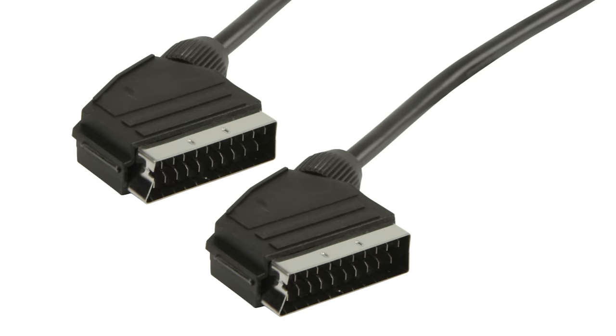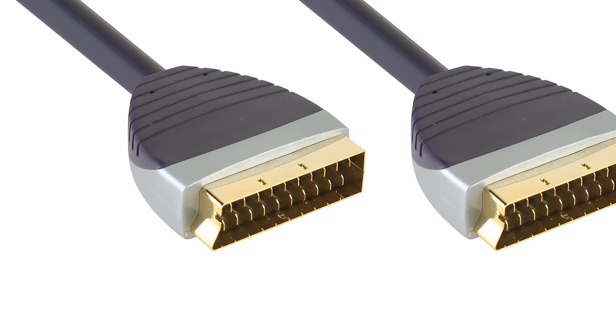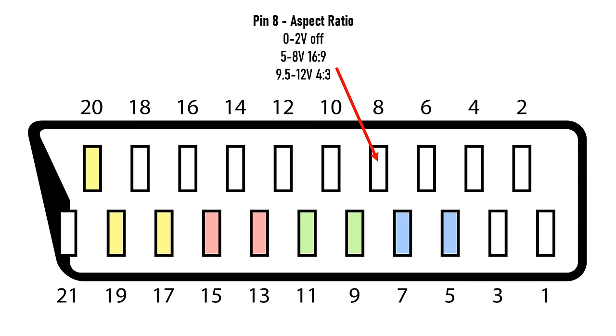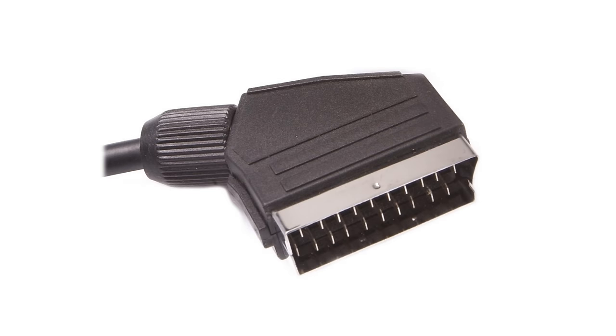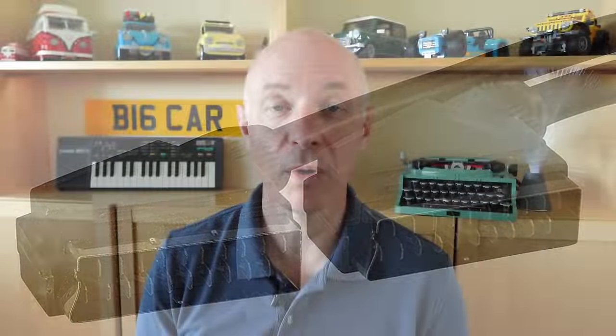All of this wasn't obvious for consumers — a SCART cable was a SCART cable, right? But high quality cables could deliver an excellent image over several metres, and could be made longer by amplifying the signal. There were more serious problems as well, with 12V going through the cable. Swapping the cable when the devices were switched on opened up the possibility of frying one of the devices if the cable wasn't connected properly. If the cable was connected to a powered TV with the other end unplugged, the large exposed shield on the SCART connector would be held at approximately half mains voltage. Inadvertent contact with the SCART cable shield while touching an earthed metal-cased device with the other hand could result in a painful electric shock. Ensuring the TV is off and connected last would prevent all of this from happening.